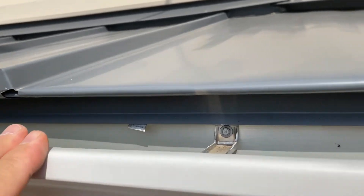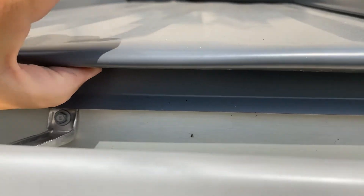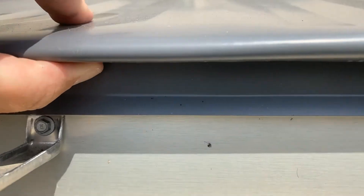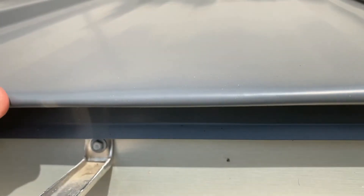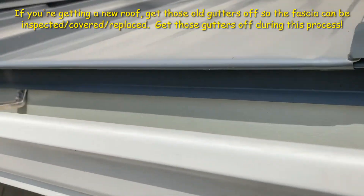Here's a different metal roof that's done the correct way. As you can see, this is the gutter — it comes back here and the roof actually stops here. There's drip edge that comes right down here, tucked up underneath this metal roofing, and drops right down into the gutter. So there's no way you can stick your hand up there, and it goes the whole way.